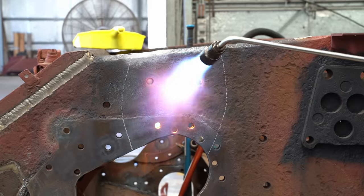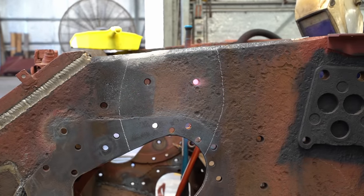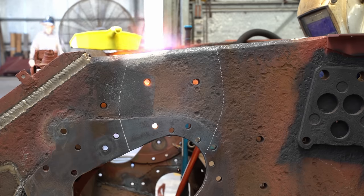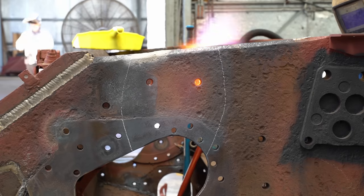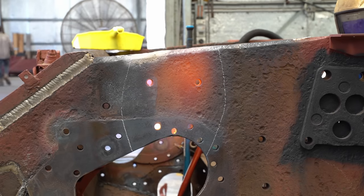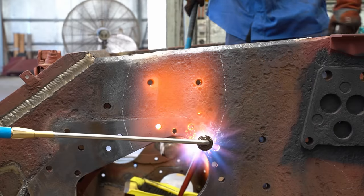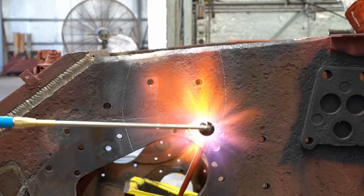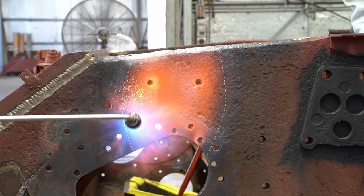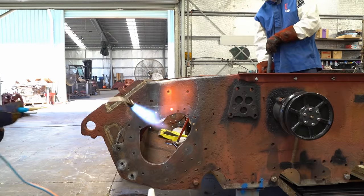As we mentioned earlier, this side was severely bent and twisted. Last time, when we went to bolt on the final drives, there was a difference of about 11 millimeters, or 7/16 of an inch, from the bottom to the top. To take this much material off the spacer plate through grinding would have been totally impractical for us. For this vehicle to run properly, the drives have to line up with each other as near as perfect as possible. So believe me when I say, Beau will be able to make the necessary minor adjustments with this sledgehammer.